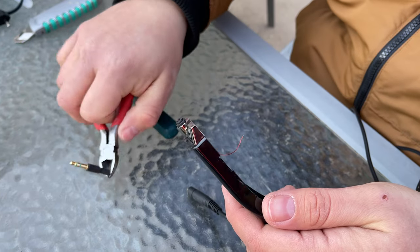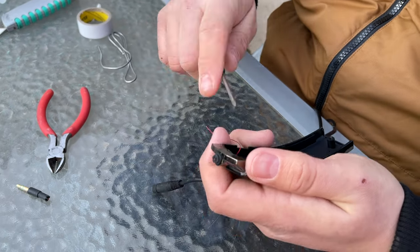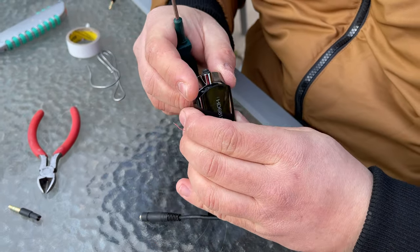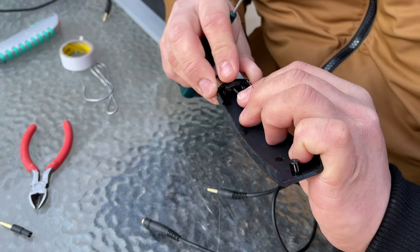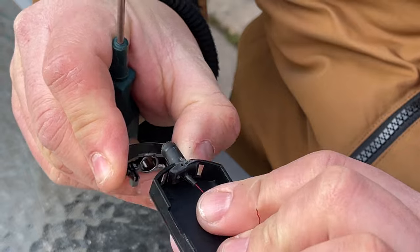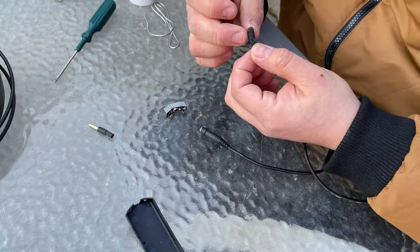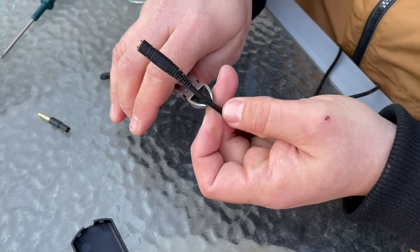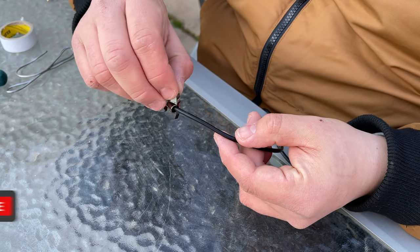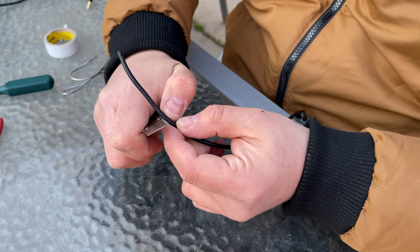The next thing to do is to cut off the short cable, and after that you should gently pull down the chrome part at the end of the cover. I'm not gonna cut any part of the video so that you see how we struggled with it. Now my friend is going to cut the end of the cable — I got the 3-meter cable with the headphones. Then you should put the chrome part onto the cable and strip off about 4 or 5 centimeters from the end of the cable.